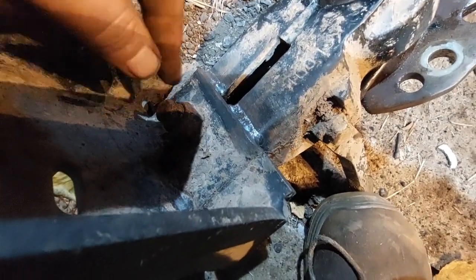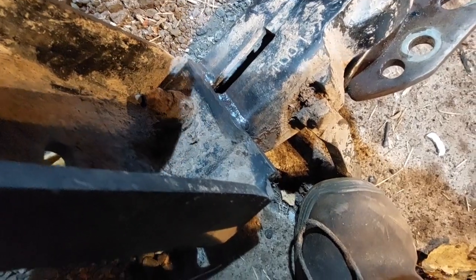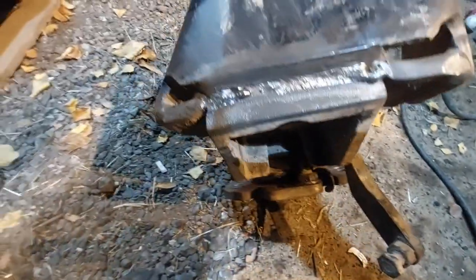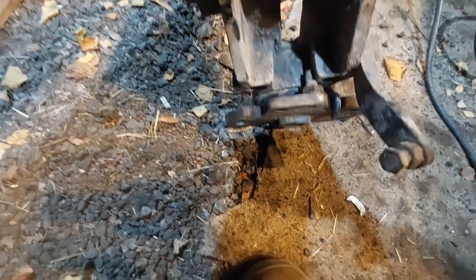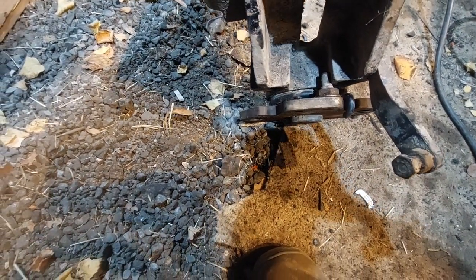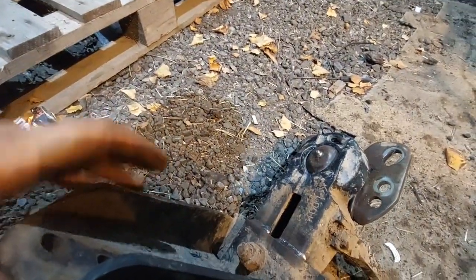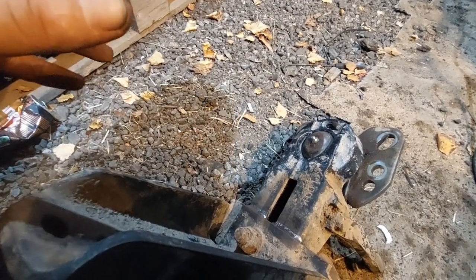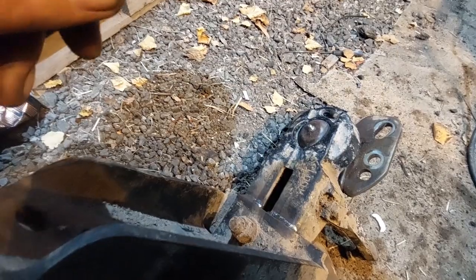And we've also, that nut, I've just never been able to get it tight. Always loosens up. Mudguard starts flapping around, annoying me. So, runner weld on the front, runner weld on the back. It is sort of welding onto cast, so it is a bit funny stuff, but welding it in front, hopefully it should hold it now. At the very least, we've got stops to stop it wiggling around too much.